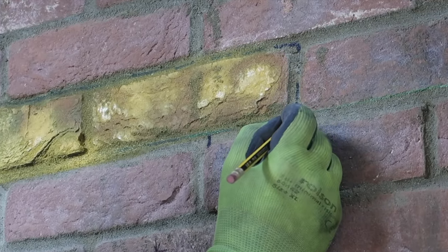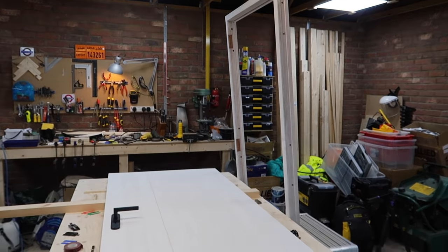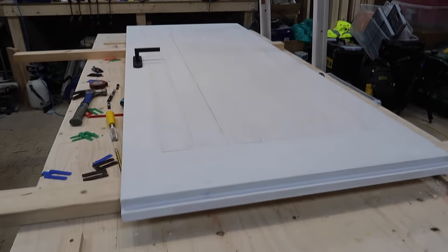The plan today is to break out these five bricks I've marked up in yellow and replace those with a reinforced concrete lintel. Once that lintel is in place and the mortar around it has got some strength, then maybe tomorrow I can do two saw cuts, one either side, and open a doorway here and fit a door and a door frame which I've already got made specifically for this job.